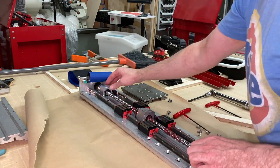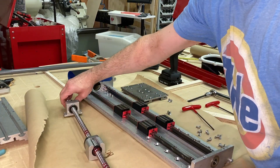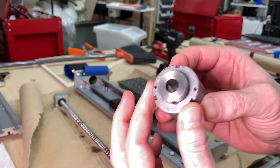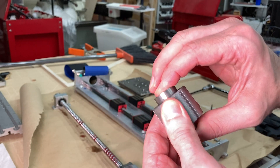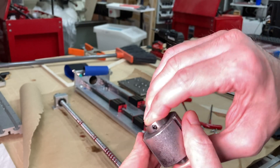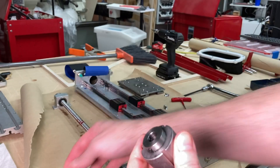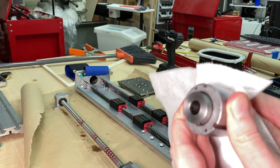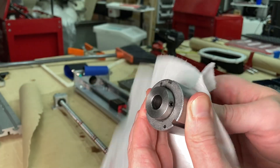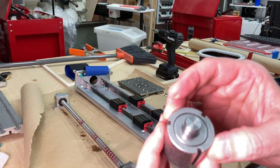So I disassemble the rest of it and pull those out, and that's when I notice this little contraption on the bottom — the drag brake. Inside I'm not sure what it's got; maybe some kind of rubber material. You can feel that it moves fairly smoothly in one direction and then binds up in the other. After talking to Avid, it turns out you don't really need it, especially if you've got a Z-axis brake, which is what led to this whole project. So I took it out. That meant the bottom end of the ball screw wasn't going to be supported by a bearing, but Avid said that wasn't a problem — the speeds aren't very high on the ball screw so it doesn't end up whipping around.